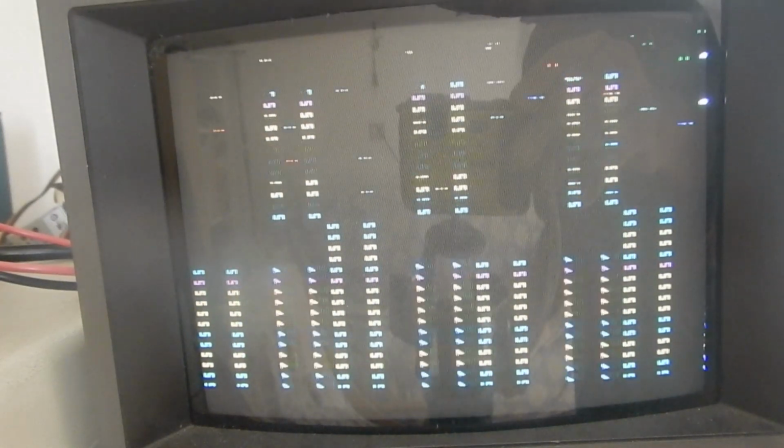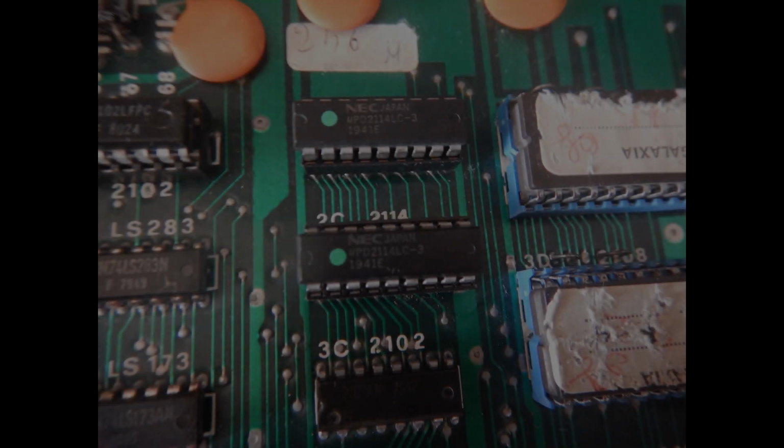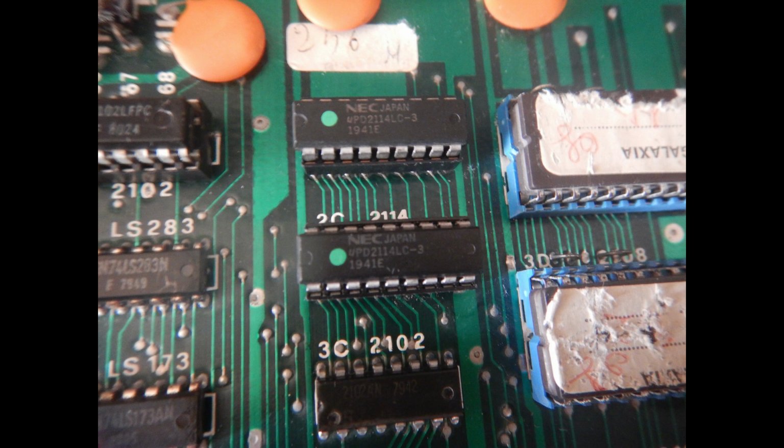Well, this is already better. Now, look at this character pattern. It is quite regular, and it seems always the same two characters repeating. For the moment, let's ignore the different colors that are stored in another RAM area. So I think that this pattern is a fault on the other 2114 in position 1C, and I'm going to pull also that one. Now, both character RAMs have been socketed and substituted.